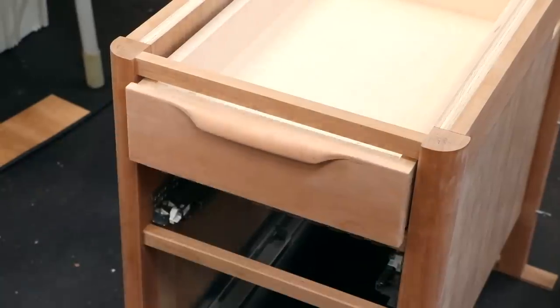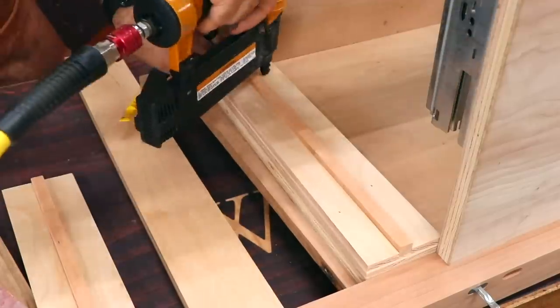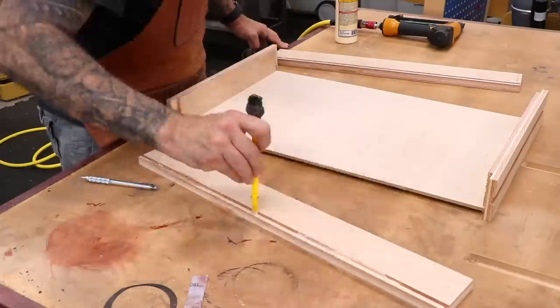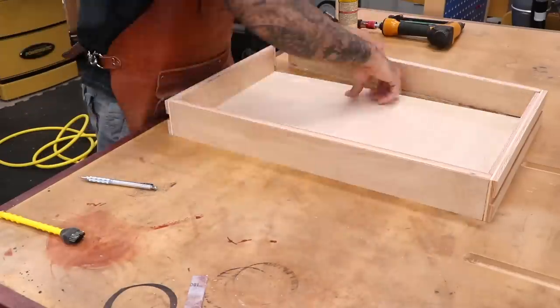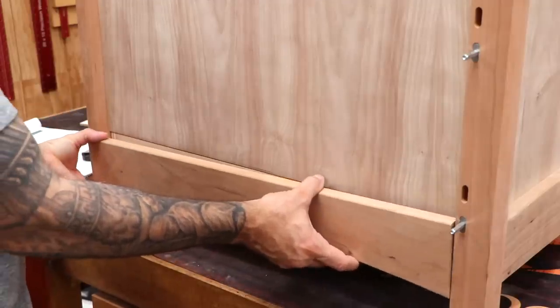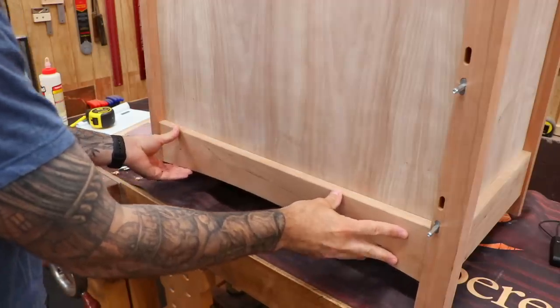What's a big giant desk without a hidden drawer? Nothing — so we'll make one. I'll install a wide drawer under the left pedestal. The key to the illusion is using the bottom inside rail as a false front. When it's closed, it's completely concealed.